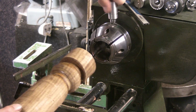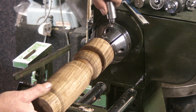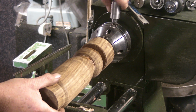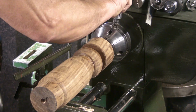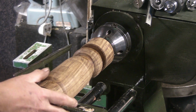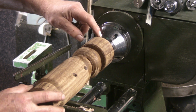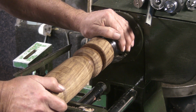So as this closes to its optimum position, this will slide in, and then as you turn it up, that internal chamfer grips onto that back plate that I've made. And that gives a really secure fixing then. The jaws now are almost fully closed. You've just got that gap where the bandsaw has gone down. So that's a really secure fixing to it.